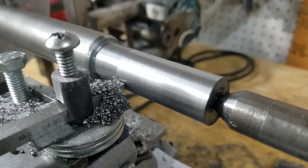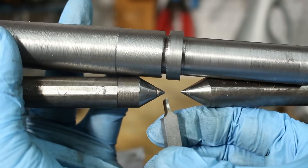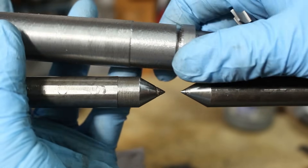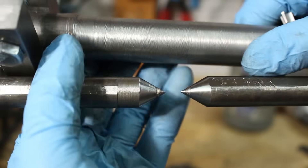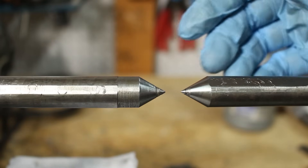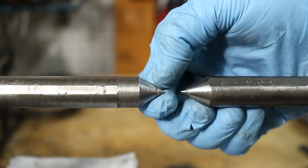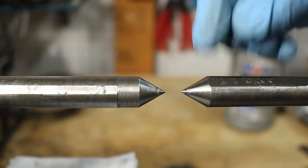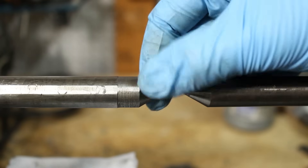The parting tool, however, generated a ton of chatter. During turning of this permanent spindle, I tried to use this parting tool to make nice square corners, but afterwards I noticed that the surface finish was just really pretty bad. I tried to track down where that was coming from — tried some different bits that were freshly sharpened, different turning tools. I finally found what I think is the source of the problem: this taper on the centers is pretty gnarly. This was actually the one on the tailstock and this is the one on the headstock. I need to freshen this back up to see if that fixes the chattering problem.